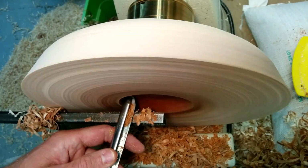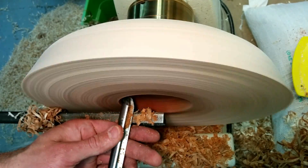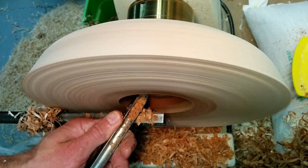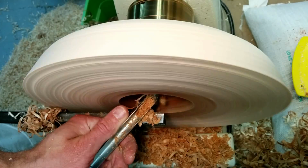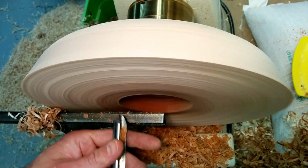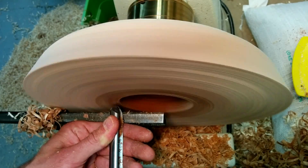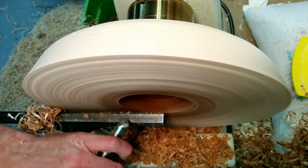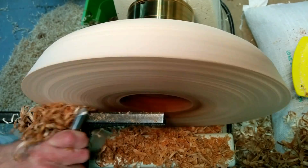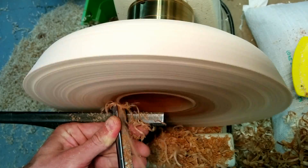There we are. And if you notice, you can hear this along the bottom. This was a nice, smooth plunge cut. Despite the chatter you might have heard from the lathe, there wasn't a lot of actual vibration going on between the tool and the wood. That's what you want out of this. If you ever see sawdust coming out of your cut, if you're pushing too hard, if it's rattling and banging all around, just stop, sharpen your gouge. That's not what you want to be seeing.